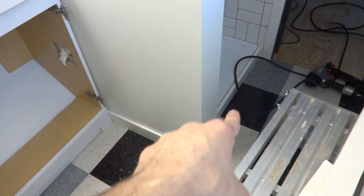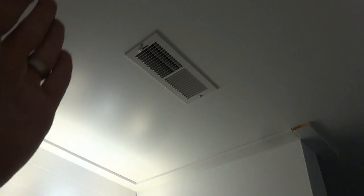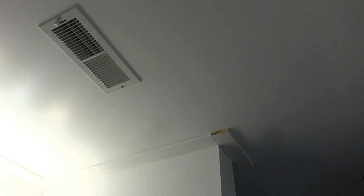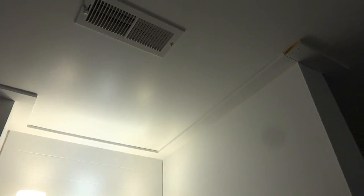I got the trim installed along the wall and in front of the shower — still need to caulk it but it's done. I also have the wall trim on the other side. Now we're trying to figure out how to do the board and batten. Normally the batten strips cover up seams on boards, but since we're kind of faking it for looks we're deciding how to make it look best. We were thinking of a cross pattern through the center, but I think dividing it into thirds will make the room look more even and it'll match the rest of the house.